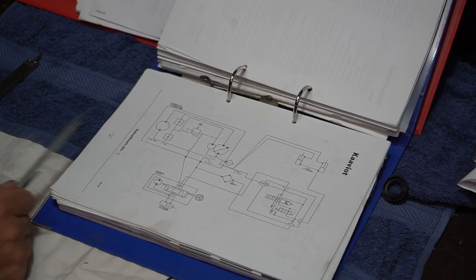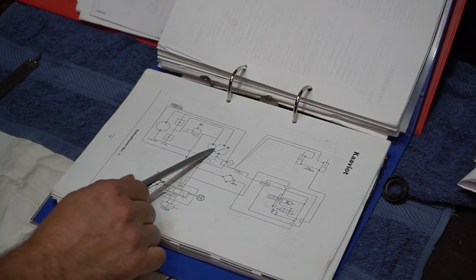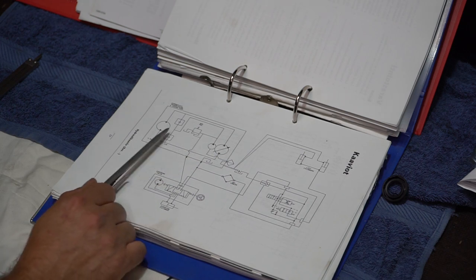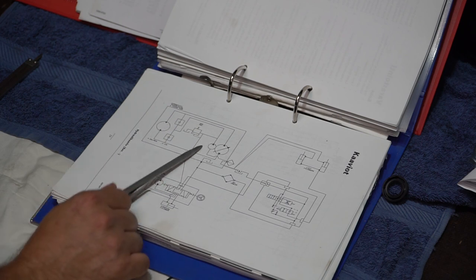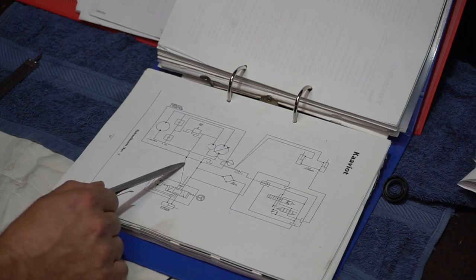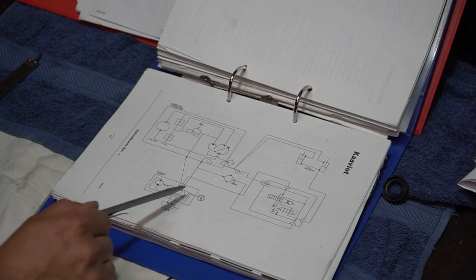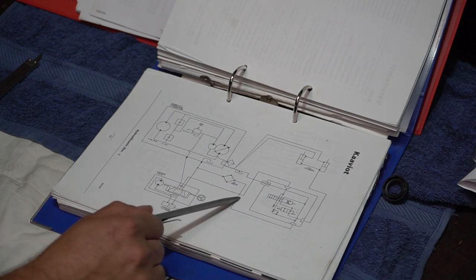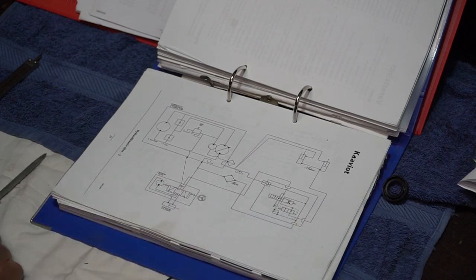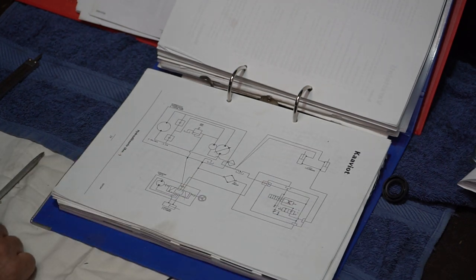About this fault finding, what we have done. Here we have the transmission side, and that small one is the charge pump for the hydrostatic, closed loop hydrostatic unit, and then that same flow is taken out from that transmission to the Orbitrol, and then the excess flow is guided towards the lifting valve. So both of these have been out of the power.